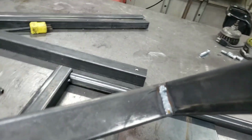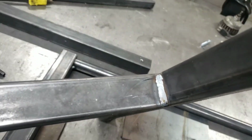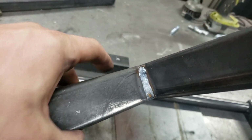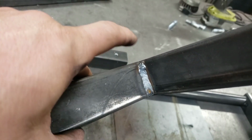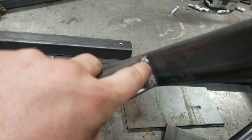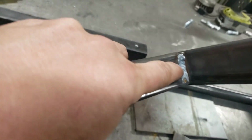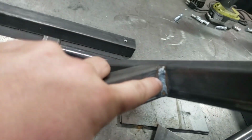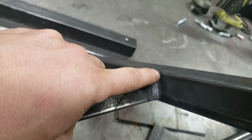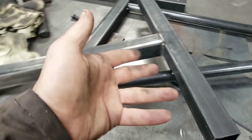And then whenever we put the top on it, we'll finish capping off the corners on these welds. What that means is, if you'll notice, I held back, just stopped a little before the corner. So whenever I finish this up, I'll come down the corner and wash back up. It's just a thing that I do whenever I'm welding points that are going to merge on several axes or several points. I'll hold back and leave a nice place so I can wash back into the first weld.